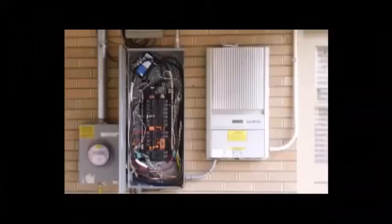The home plug is installed near the router or any available ethernet port. It receives information from the e-gauge — try to minimize the distance between the home plug and the e-gauge main unit. The first step to installing the e-gauge energy monitoring system is to install the home plug adapter. The second step is to install the e-gauge main unit.